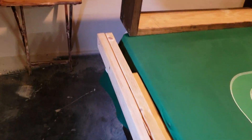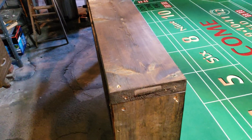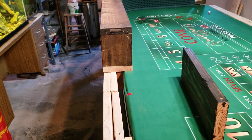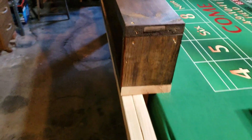I come up the side with these cleats, same way with the back, for these back rails here. You can see how it sits on the table — 2 inches. I measure each one before I screw it down, I get my tape measure and make sure it's 2 inches on each side. That's what keeps it straight.